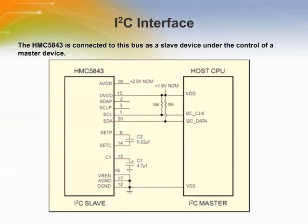Control of the HMC 5843 is carried out via the I2C bus. The device is connected to the bus as a slave device under the control of a master device such as a processor. Here shows the typical connection between the HMC 5843 and an MCU. This device supports standard and fast modes — 100 kHz and 400 kHz respectively — but cannot support the high-speed mode. External pull-up resistors are required to support these standard and fast speed modes. Depending on the application, the internal pull-ups may be used to support slower data speeds when specified by I2C standards.